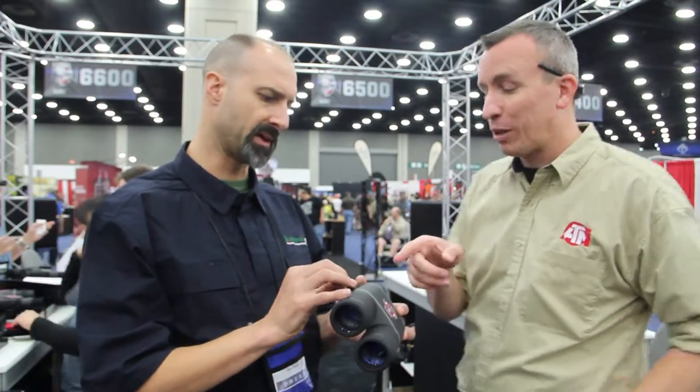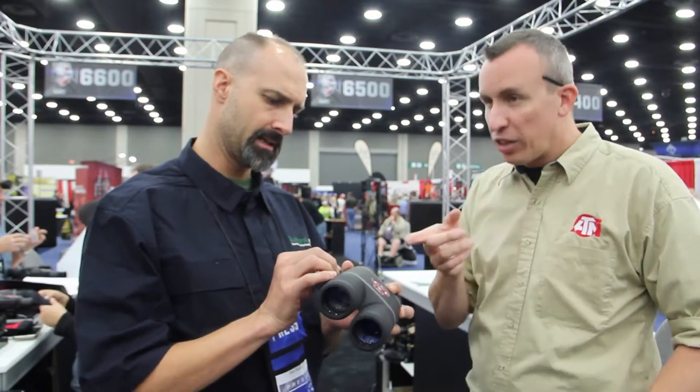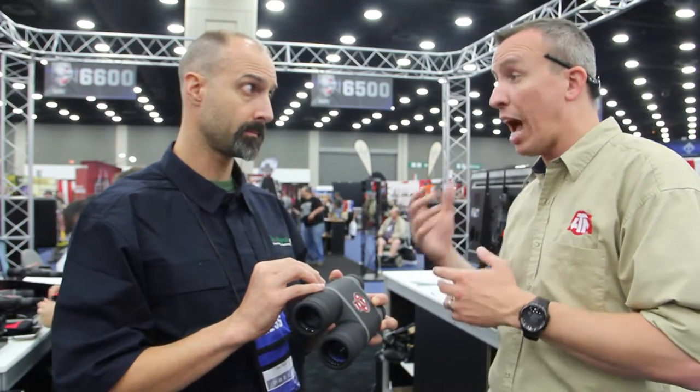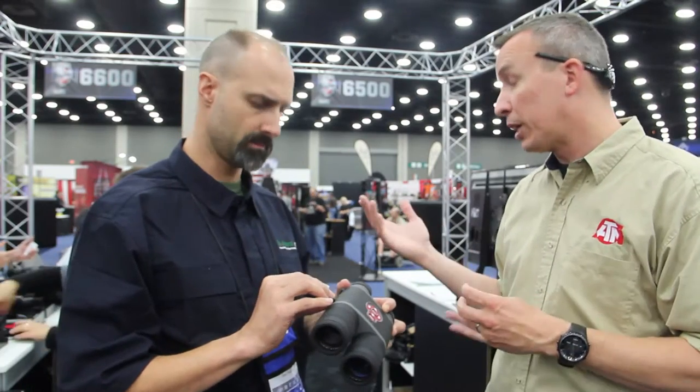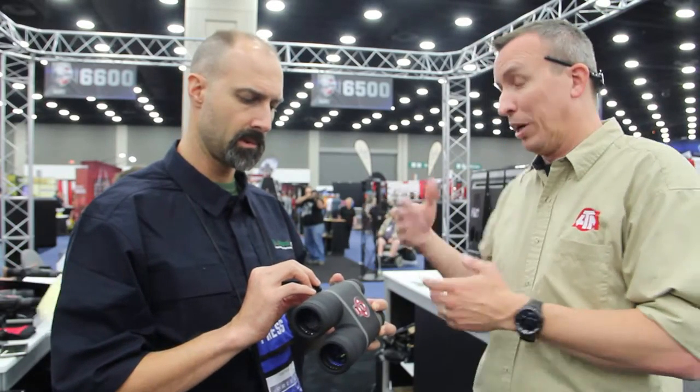You can run this off external power — yes, you can run an external battery pack via the micro USB port. The external packs are the same kind of cell phone charging packs. About 1,000 milliamps gets you roughly an hour's worth of life, so on bigger packs — we've got 16,000 milliamp batteries — you gain around 16 hours of additional use.